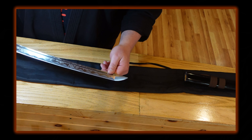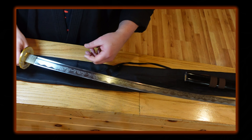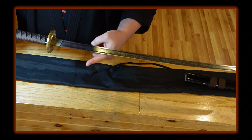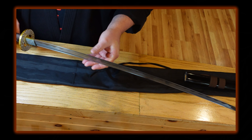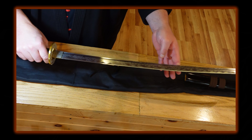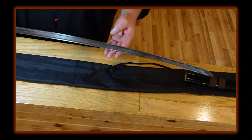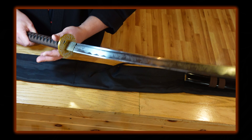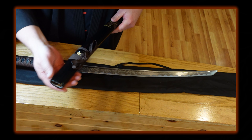The blade does have a beautiful etching — all different flowers with some sort of vine design. It's obviously not hand carved. The hamon looks etched on, perhaps with steel wool, so it's not a real temper line. There's a fake yokote line up by the kissaki, and it does have a bo-hi fuller to make the blade lighter. The blade is fairly well balanced — not as top-heavy as some others. It is sharp; this is a shinken sword, which is why I told them to remove that false 'iaito' advertising.